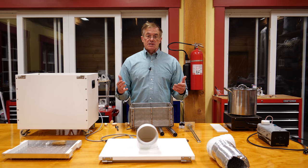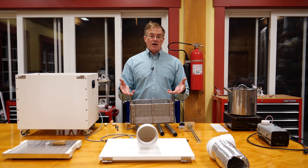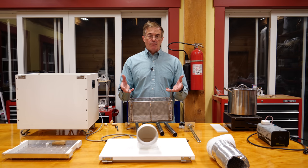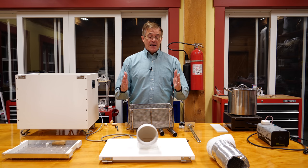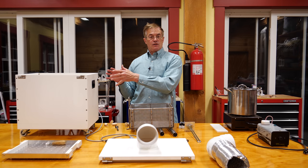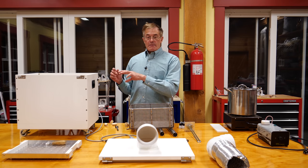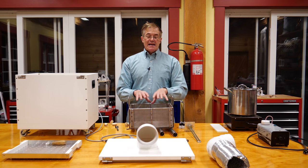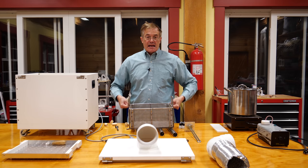In a typical commercial system, the low-end ones have the basket raised and lowered into a reservoir of hot water by heavy-duty levers. Those systems are a little less efficient because you need pretty robust levers to lift 15 kilograms of ice, and it makes the box itself larger for any given capacity. So what we decided to do is base this on a system like the high-end units — we pump hot water up through the ice, drizzle it down onto the dry ice. That's nice because the hot water is easy to manipulate, makes it more compact, and we don't have to manhandle the heavy basket full of ice.